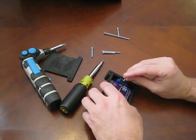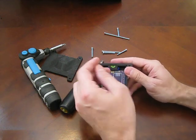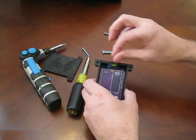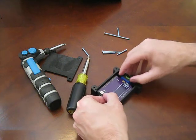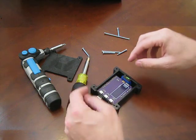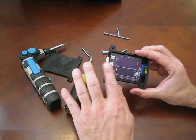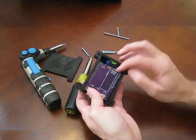Usually I have a little sheetrock screw that I screw in there and I can pull that wedge out. All you do is screw in the little sheetrock screw and that wedge just pulls out, and that releases the tension on this. Then you can take this and just slide it all out together, take your unit out. When you put them back together, you go ahead and put it in here and just kind of slide them down there, and it puts pressure against the front a little bit.